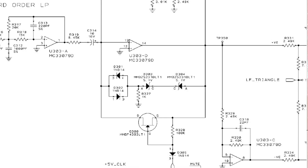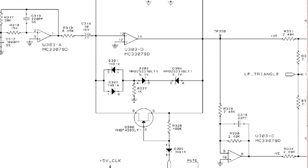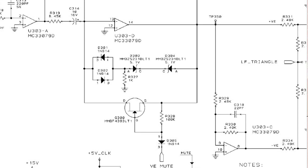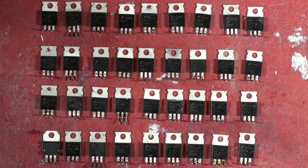I think I discovered what causes it, and this is probably what's plaguing the 515s — if there's a power dip, the startup to the enable for the digital drive to these things is indeterminate, and if you catch it just right, you can blow them up.